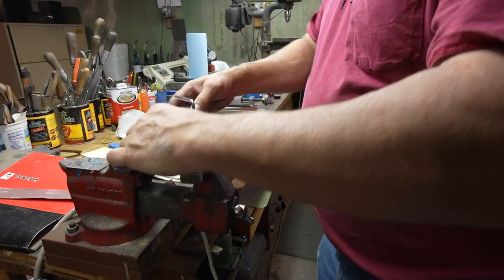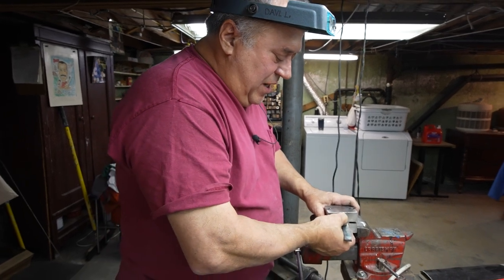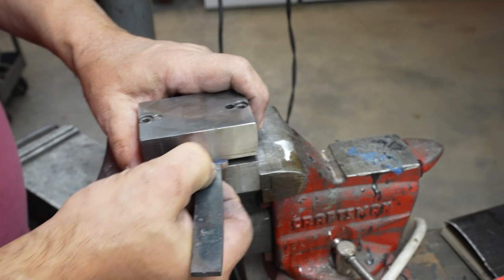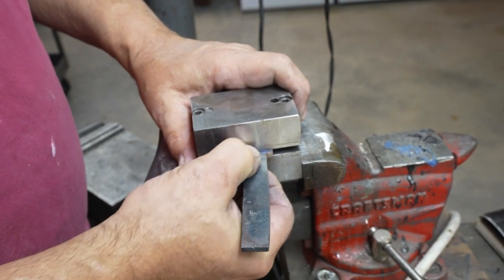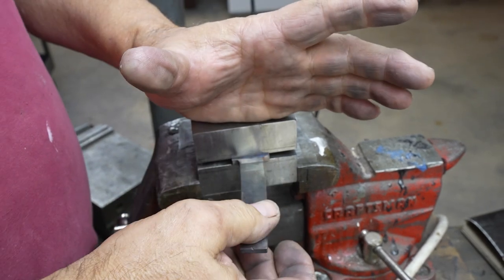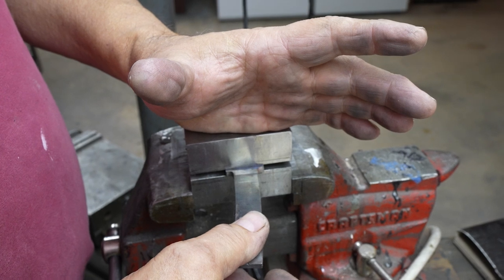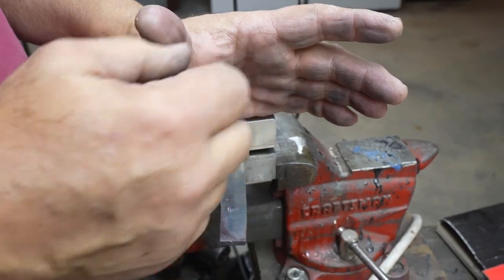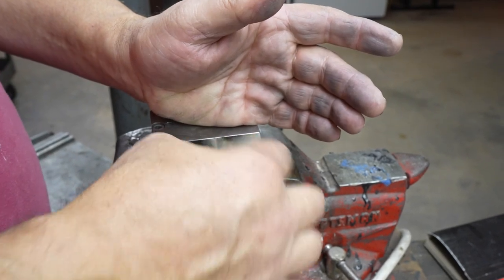I usually reduce the thickness of the blade right behind the ricasso by 5 to 10 thousandths per side. So between 10 to 20 thousandths, this will be smaller, so that when it slides up to the guard, you've got that shoulder there. Any imperfections in the guard, especially if I do it by drilling and filing, will be covered up by 5 or 10 thousandths worth of land.